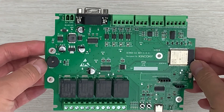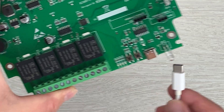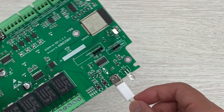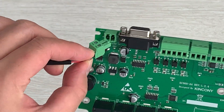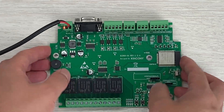Let's step by step configure the ESPHome. Let's look at this A4 board, which is made with an ESP32. We connect it with a USB cable — the USB cable is connected to our server which has a Raspberry Pi USB port — and I have also connected DC 12 volts so that the relay LED will be on. The hardware is ready.